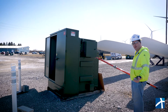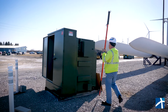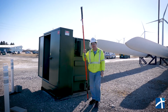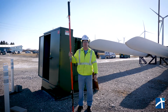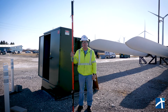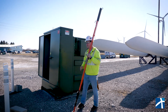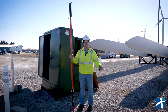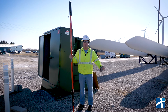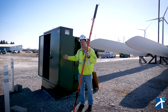We're able to do it in our normal PPE. We aren't in a full bomb suit because we aren't exposed to the risk the bomb suit was trying to mitigate. With engineering controls, we took one of the most dangerous high-risk things we do and completely eliminated the problem. And by the way, you can order this from most transformer manufacturers now. So I encourage everybody: look at the engineering controls you can implement to get rid of the problem. Never ever order a transformer with a switch on the inside again.